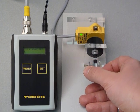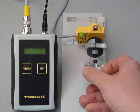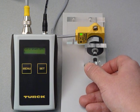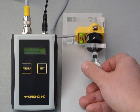Another feature to mention is that the sensor is absolute within its 360 degree rotation. So if the element were to move back within the sensing range, it would provide the appropriate output given the new position of the element.